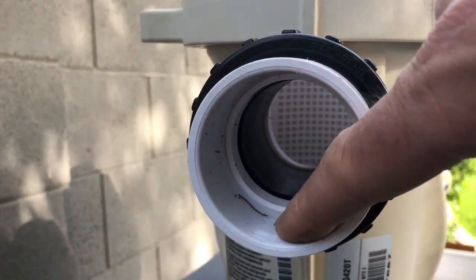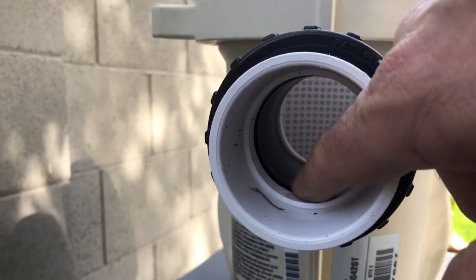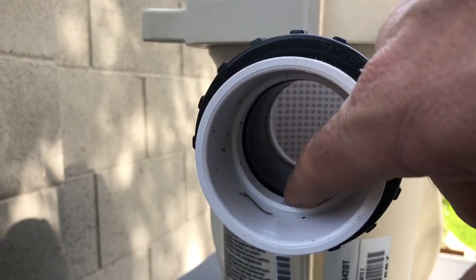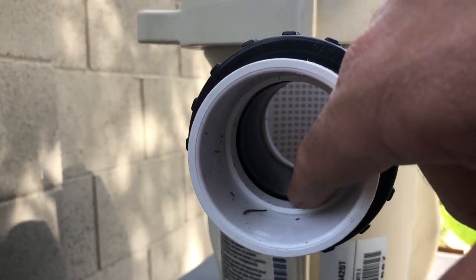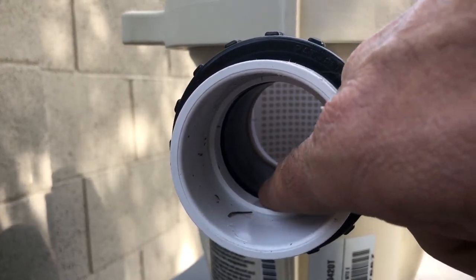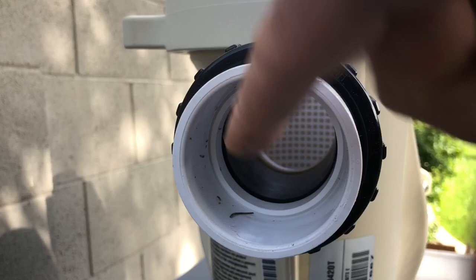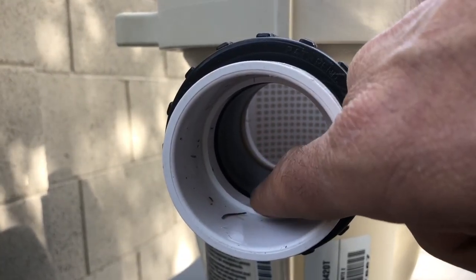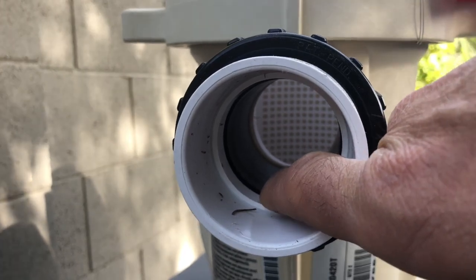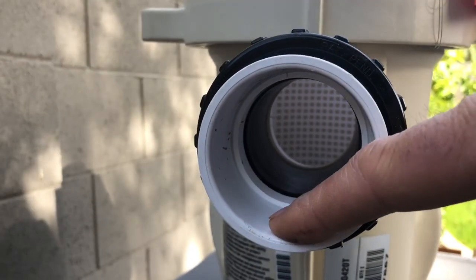Glue will sometimes pull up in here instead of running out — it's going to run this way. What we don't want is any glue on the faces of that rubber seal. So we snug this down so that if any glue does run over here, it'll stay running over the top. Then when it dries, we can break it loose, but those faces that actually do the real sealing won't have any glue on them that would damage the surfaces we need to be perfectly flat.